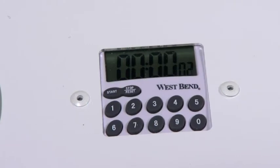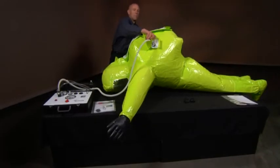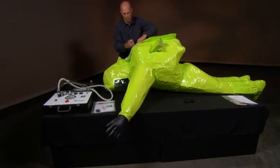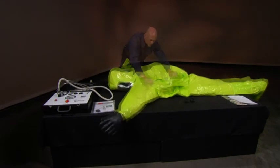At the end of 4 minutes, the suit will have passed if the gauge reads 3.2 inches of water or higher. Remove the test kit adapters from the valves. Open the suit zipper. Reinstall the diaphragms and protective covers, and record results in the logbook.